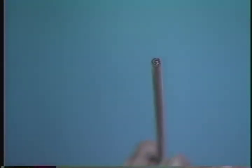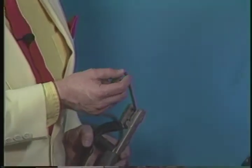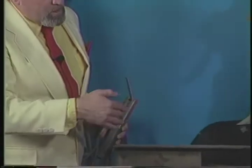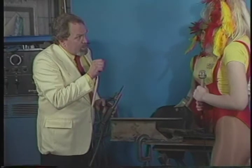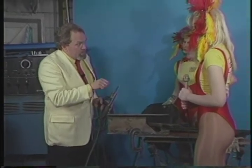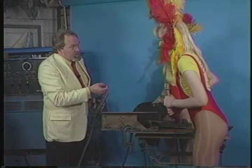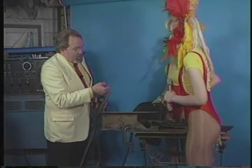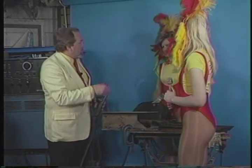By this, you actually drag. You actually apply light pressure to it and just let it feed at its own rate and drag it across. It's called contact weld, and that's what it looks like after you've welded a little bit. Now, in order to establish this arc, you're probably going to have to whack it on there kind of hard. In fact, I'll help you with it a little bit. We'll just take and whack it hard. And the reason being is that it's not going to really recognize that the filler metal is touching it. That's not that great of an electrical connection. It's just slightly, so we got to jog it into action.